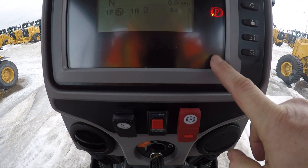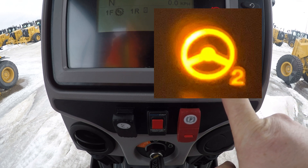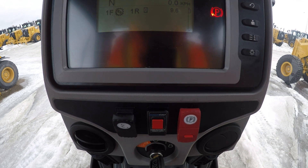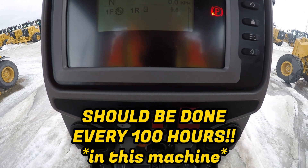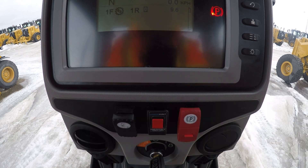If, under normal operating conditions, that steering wheel warning light comes on, that means the primary pump is not working anymore and you're running on the secondary pump. The secondary pump is not designed for you to keep working. If that light comes on, it's designed to get you off the road somewhere safe so that you can stop the machine and sort out what's going wrong — it is not a pump you can continue to work the machine with. Always reference your operation and maintenance manual for the exact procedure in whatever machine you might be running. This is a CAT 150 all-wheel drive. Just always reference that OMM.